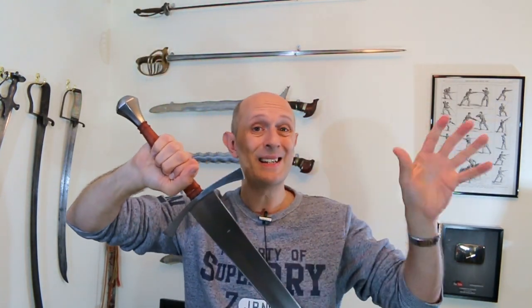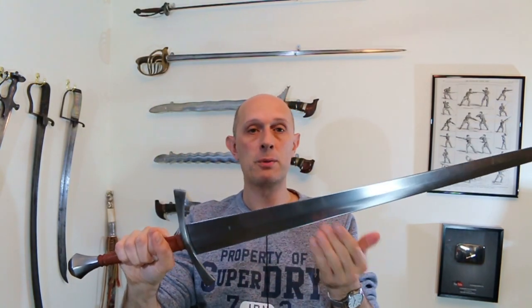So actually, by the time you've hammered that on, you could hold the sword by the tang and shake it around, and that guard isn't going anywhere. It should be absolutely tight, and that's what gives you a ring on a sword like that — everything solid — and it means that when you use the sword, the guard won't get loose even if the wood contracts or falls away. And this is evidenced in archaeological examples: we have many medieval swords where the organic material has rotted away, especially river-found swords famously, and the guard hasn't come loose — it's still there, still solid, because it's been forged on.